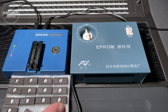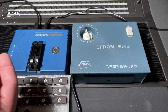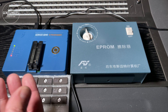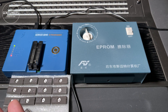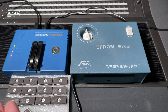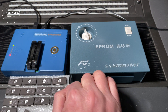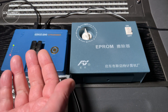We will need some things to be able to make new sounds for the LinnDrum. First, we need an EPROM programmer. EPROM is an acronym that stands for Erasable, Programmable, Read-Only Memory. We can write memory onto these chips using a programmer only if they are erased properly. EPROMs are reusable devices — unlike ROMs — and you need UV light to erase them first if you want to reprogram them. I found this cheap Chinese USB-connectable programmer some years ago and it still works. It also came with a small UV eraser with a timer. It takes normally about 15 minutes to erase the EPROMs — you put them in this little basket, switch it on, and the UV light will erase them.